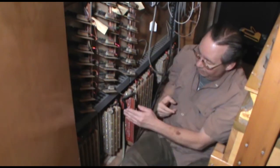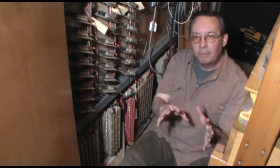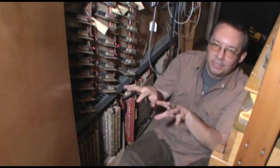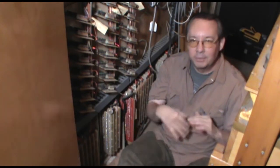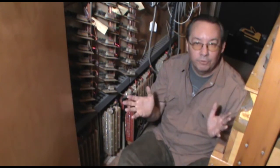The way we're going to connect the PIM and the driver cards is the driver cards will be plugged into the key point and stop switch points, and then we'll program the PIM to run those from the particular stops on the organ console we want. The end result is the organist just sits down and plays the organ. When we do a hybrid organ, we want it to be seamless — not a group of electronic stops here and pipe stops there. You just sit down, play the organ, some stops are pipes, some are digital, the whole thing is coordinated as a single unit system.